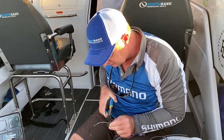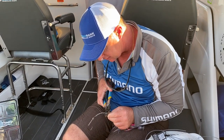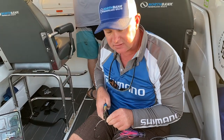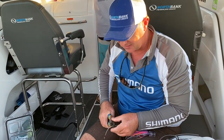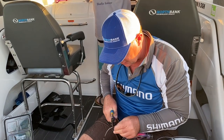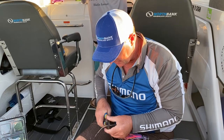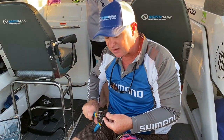Crimp it on there. With your crimps, always make sure you take the time to make them sit exactly the way they're meant to, and never crimp the corners, obviously. That sounds silly, but the amount of times — I saw a bloke who used to do it with a vice, can you believe that? Crimp down, crimp down. And of course, remember to do the other one — gives you added security as well.